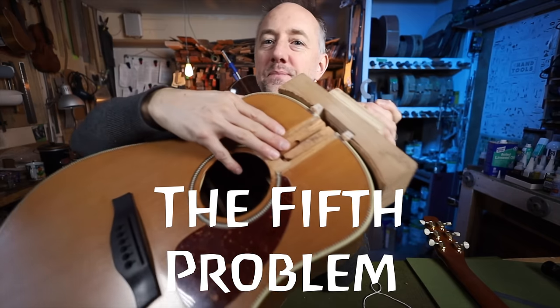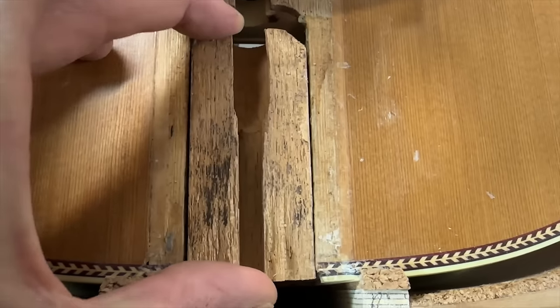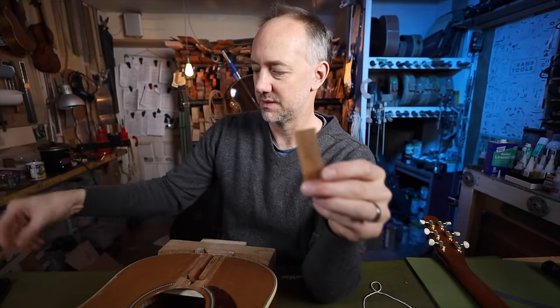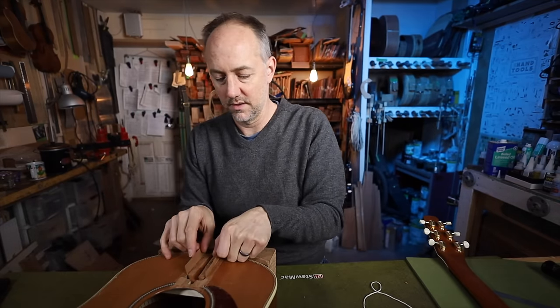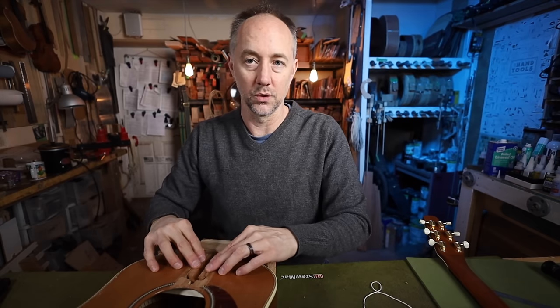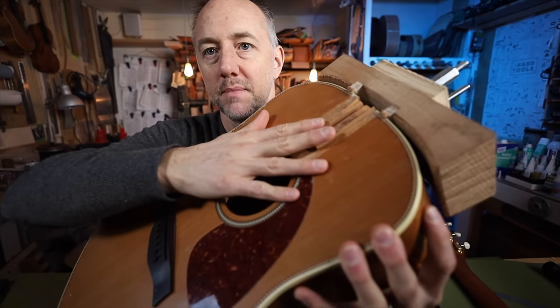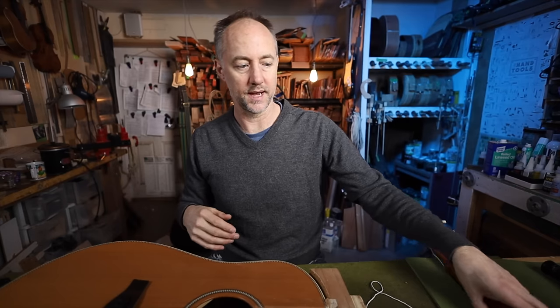The other thing, it has side slop. And it's about 20 thou each side. So what I'm also going to do is glue in 2 veneers on either side of this shim. And it's still a little bit loose, but that with the glue, it'll be good. Then I'm going to plane this whole mess down. Then I'll have a Seagull guitar, which was like the Seagulls that I was working on in the early 2000s.